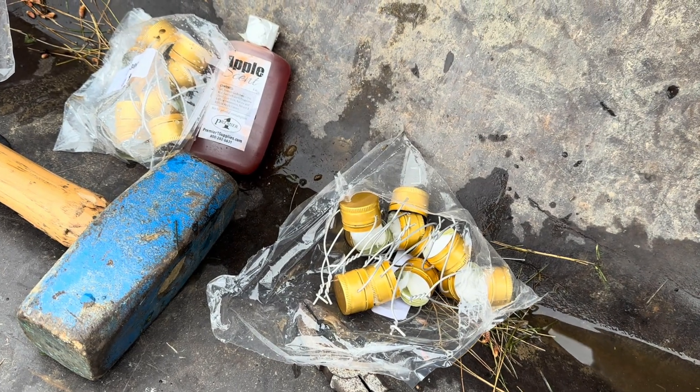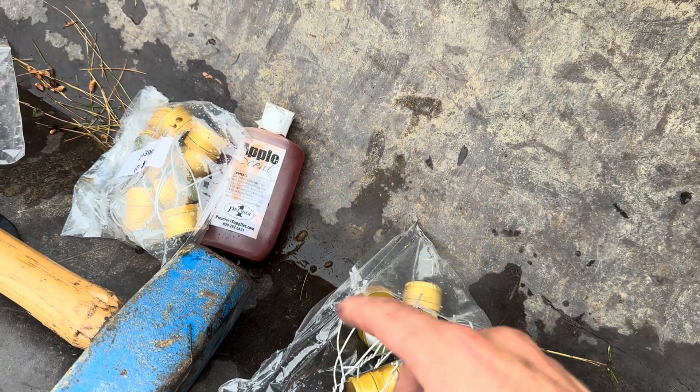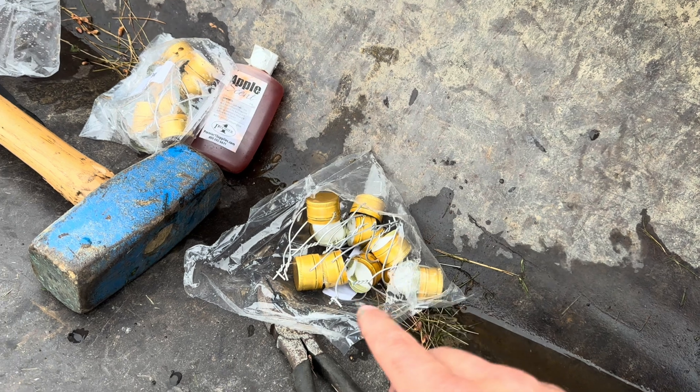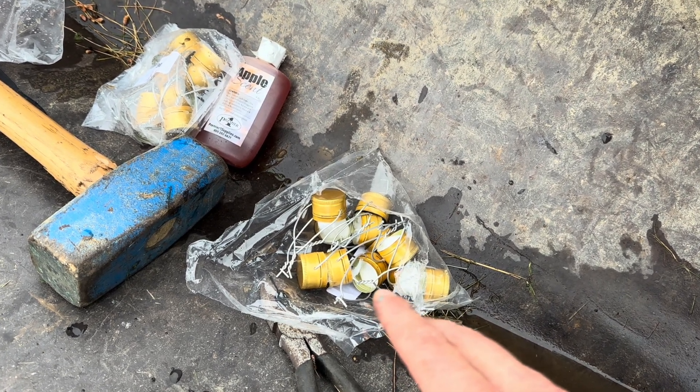The outer fence line at 30 inches off the ground is now complete — it's run all the way around. I pulled it as tight as I could by hand; this is low-tensile fence so it won't be super tight, and I have some tensioning devices to tighten it up after. Now we just have to run the three strands on the inner fence at 20 inches, 40 inches, and 60 inches. All the fence strands have now been run and set on insulators on the fiberglass posts all the way around. I've hooked up the fence charger; next thing is to bait the fence. I have these little bait caps with cotton inside and apple scent — I'll saturate the cotton and hang these on the outer 30-inch fence line.